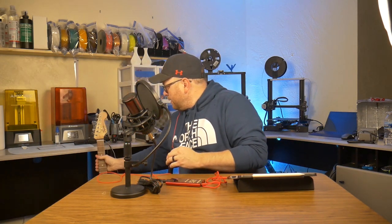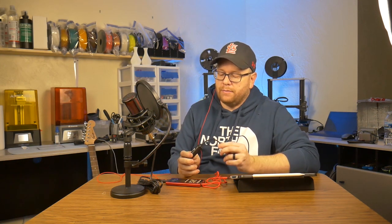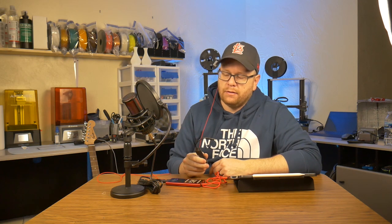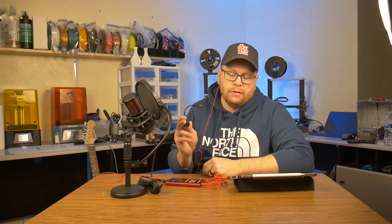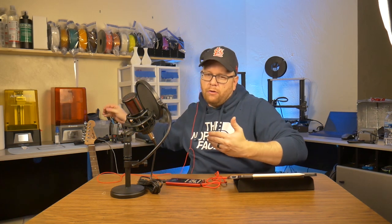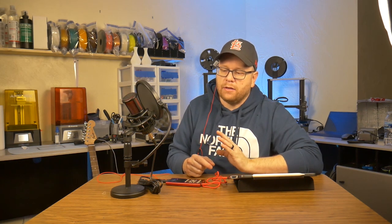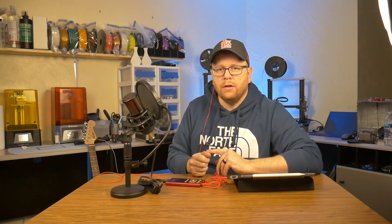Okay, same thing. I hooked the guitar up, made sure the volume was up and everything, and plugged it all into the accompany port, and nothing happened. I think it's just because it requires a powered input, and I don't think this sound card provides any type of phantom power, and it's not going to substitute for a direct box or anything like that. So it's just going to be compatible with either passive devices, like this microphone that it comes bundled with, or with devices that provide their own power, like amplified power sources.